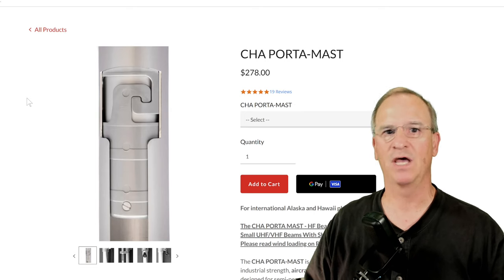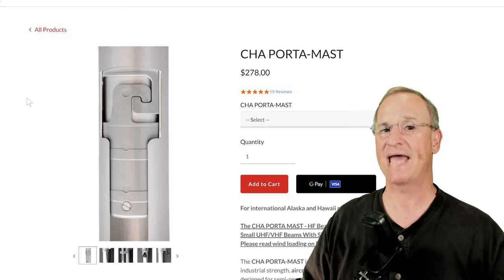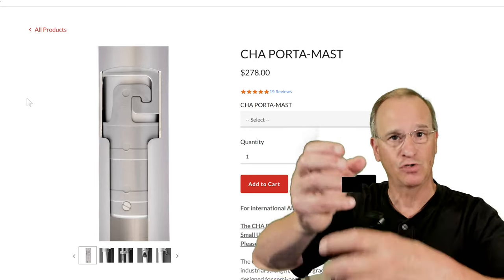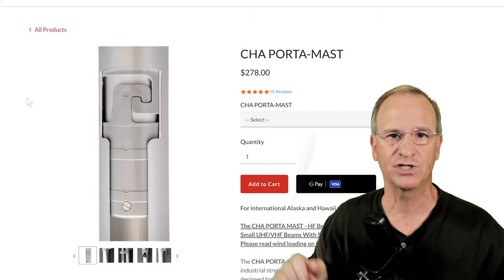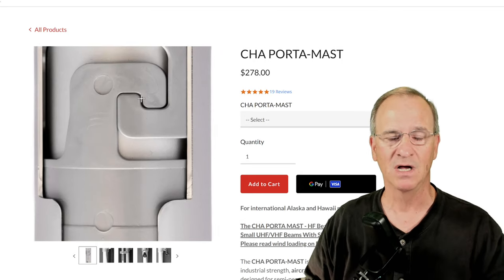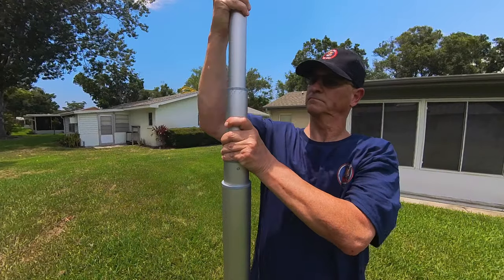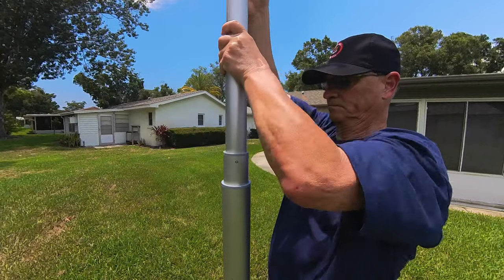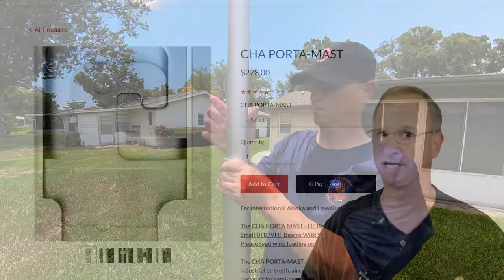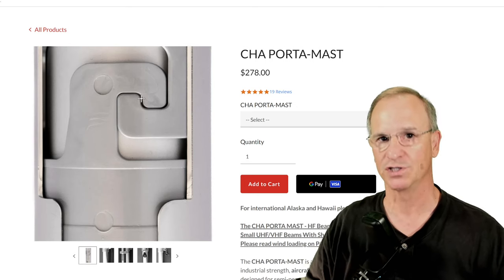Let me give you a couple of tips and tricks. Whether or not you hang a flag off of this telescoping antenna mast, this is a mechanical engagement system. This is not like our telescoping fiberglass masts where you take two sections, separate them, and twist to create friction. This is actually a mechanical engagement system. As you can see from the brief video here, you pull up the top section, it will hit the next section's engagement system, twist it slightly counterclockwise, lift up a little bit more and a little bit more counterclockwise, and then it goes down and firmly engages. Do this section by section and this is a solid mast up in the air — it's not going to collapse like those friction systems do.